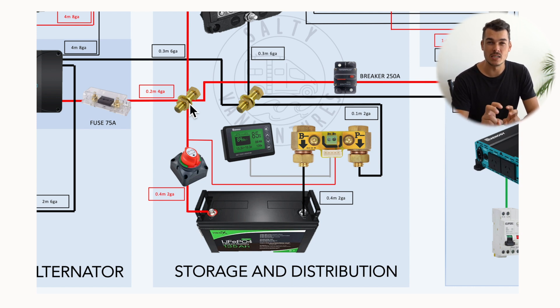That goes up to a bus bar. I didn't use a typical bus bar you can buy from the shop — I had some big thick brass bolts. Bus bars are about 20 bucks; these brass bolts were a couple of bucks, and they basically work the same way. All my connections are terminated with eyelets that are soldered onto the cables, and then they all go onto either a negative or a positive bus bar.